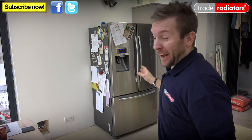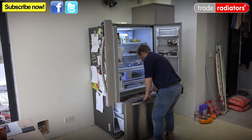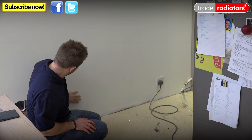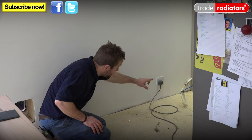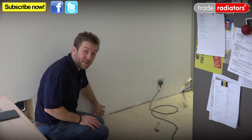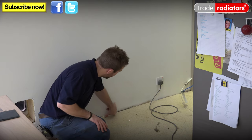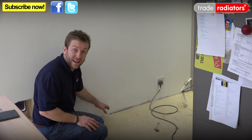First things first, I've got to safely get out this absolutely gigantic fridge. Looking down here, we can see the plug just here — that's where I want to put the centre of our radiator. The two pipes I want to run along here behind that kickboard, making two little holes and popping them through. Later on there will be a small piece of skirting board going along here, so in the interest of hiding the pipe and making the install look as good as possible, I'm going to channel this out and put our two pipes in there, then cover it over when the skirting board is put on in a couple of days.